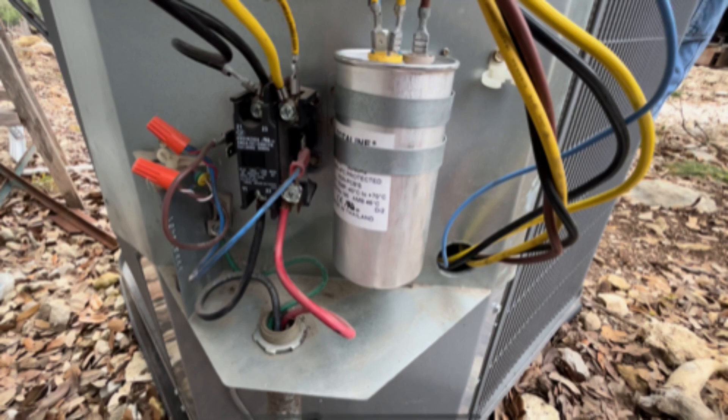If you see another piece of hardware near your capacitor and contactor, it may be a hard starter. A hard starter ensures your compressor gets maximum amps on every start, which is the opposite of what we want. The instructions say you need to remove any hard starter if your unit has one, because it will counteract the smooth starter. Newer units often don't have them, but some older units may, so check first.